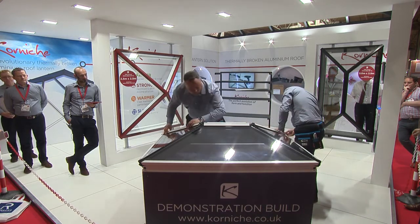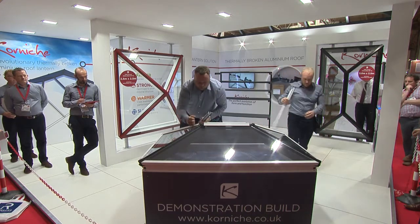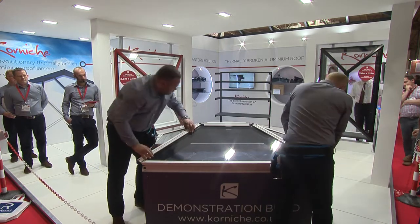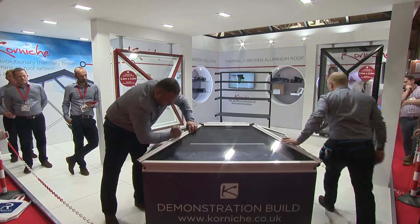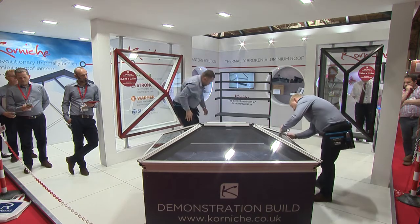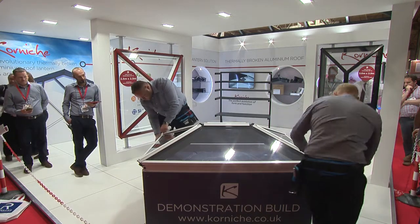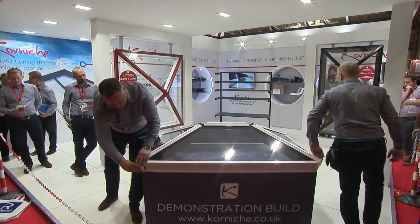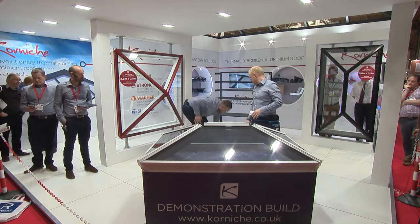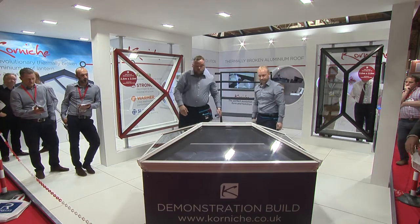Line them up at the ends and just apply a bit of pressure onto them until they clip into place. Then the end caps that Bradley put the clips in earlier on, again, push fit. Finish the hips off nicely, and the last job is just to fit the two boss top caps. And that's the roof complete.